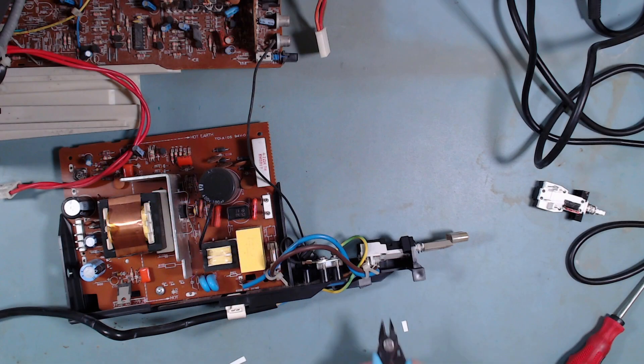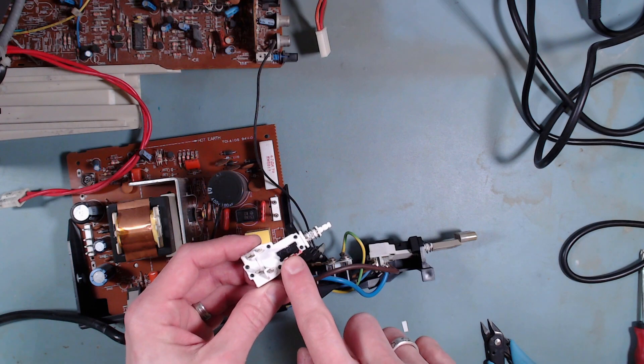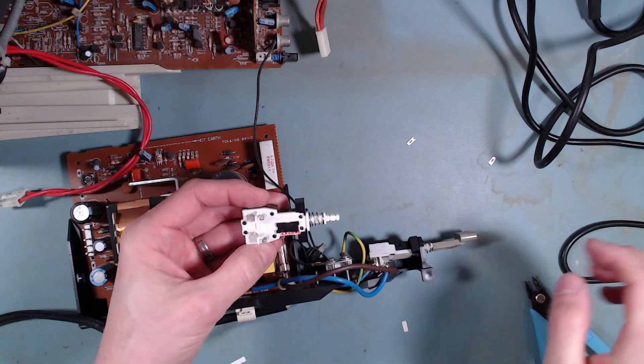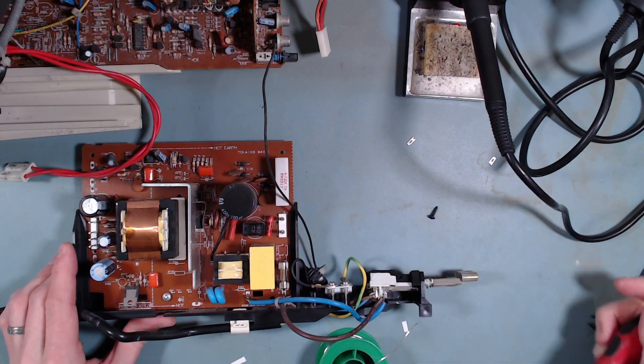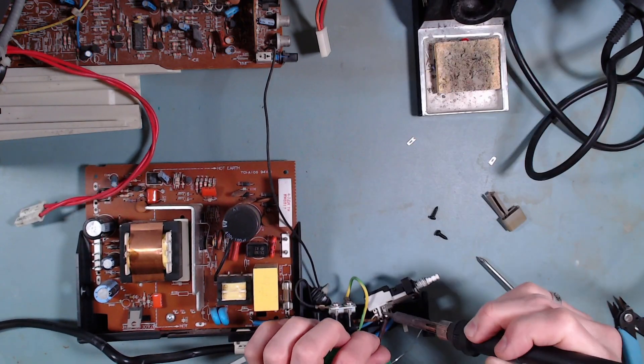Taking a closer look at the switch, I'll cut off the cable tie and take a closer look at the connections. You'll notice my replacement switch has an extra switch on it — this isn't needed for this monitor, so I can simply cut those off. Next I'll unscrew the switch to get better access to its contacts, remove the plastic switch, and then desolder it.